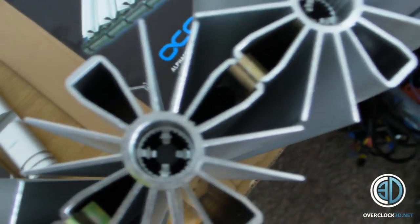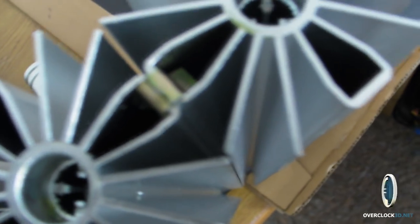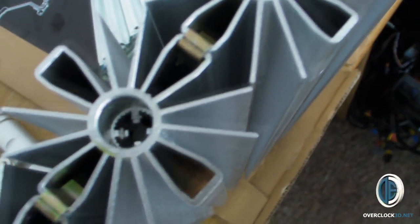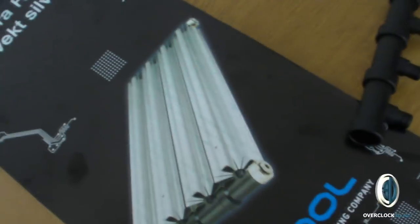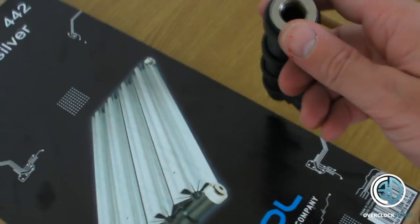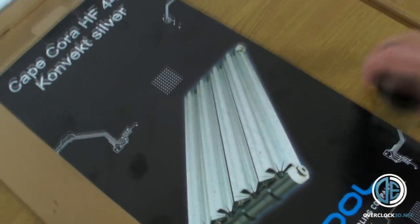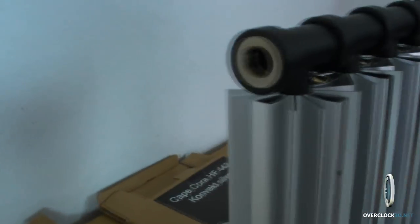What I wanted to do was show you the inside of the radiator. You can see it's not just a plain hole - there is an extrusion on the inside. I'm going to get back to fitting these, but what I'll tell you is regarding these ends - that's the blanking plug that goes in the end. You have to remove that to be able to join the bits together, because there's one there, so you do have to take it out.